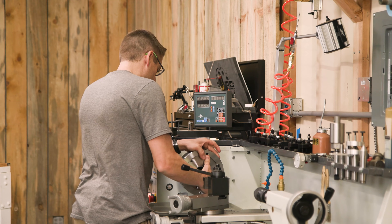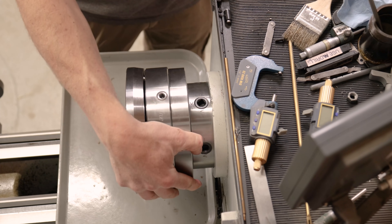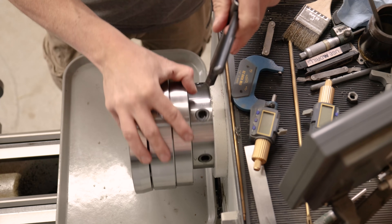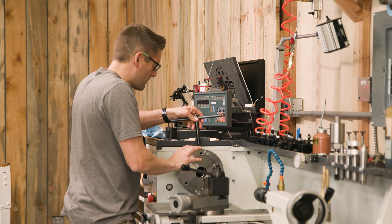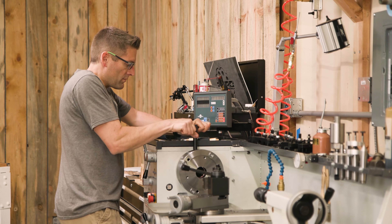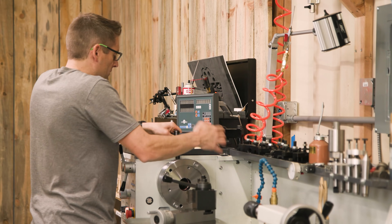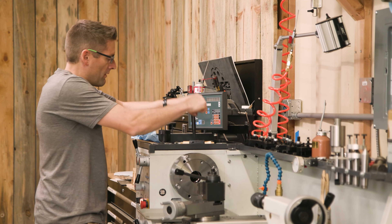I'm carefully aligning the pins and finding my number one pin. I'll probably stamp the Truebore Alignment System adapter plate so I can keep number one in the same orientation each time I attach the T-BAS system. I'll tighten the cam lock pins in a star pattern — skipping one, going to the next, repeating — then going around one more time to make sure everything feels solid. We are mounted.